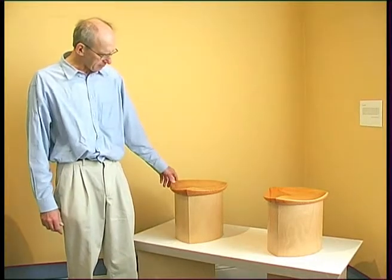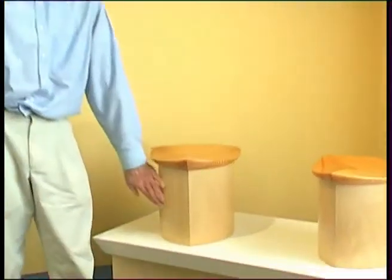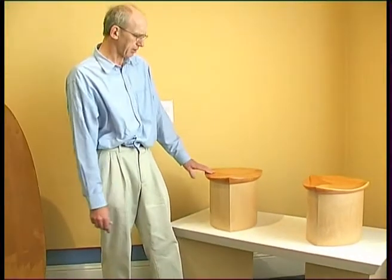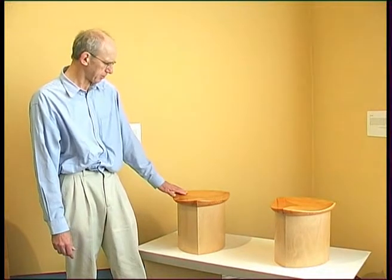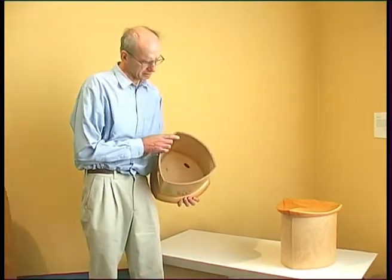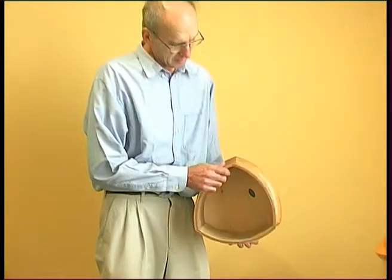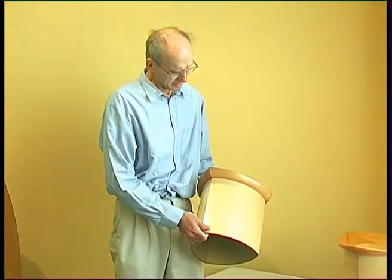These stools are constructed from aero ply, laminated into this curve, and Oregon pine. The inspiration was watching someone sitting uncomfortably at a fireplace, stoking it on a very inappropriate stool. I thought, no, I could do better than that. As you can see, this is basically tubular. Triangles are wonderful things to use in a design sense. Extremely strong. This plywood comes from Finland, and as I said, aero ply is used for aircraft construction.